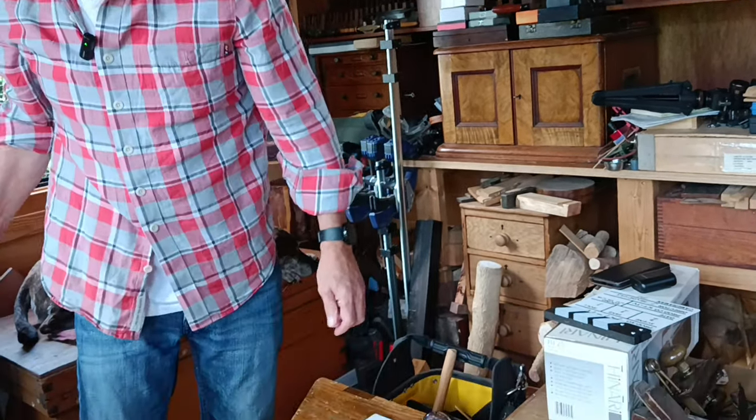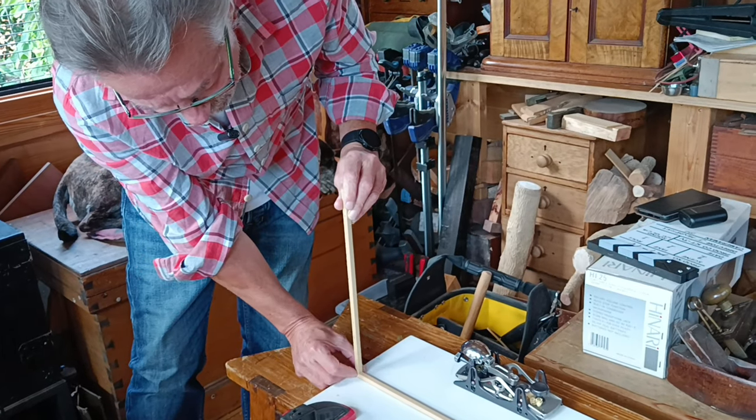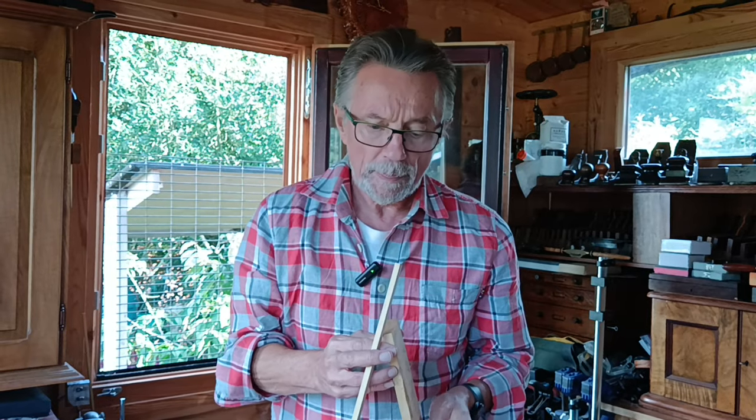So this week that's what I'm doing — making loads and loads of these beams all to size, and slowly but surely I shall be making mortise and tenon joints in each of the corners. And then we had a great discussion last night on Bench Talk, because I need to bore these. We worked out the pegs for draw boring to 1/20th scale, or actually one millimetre. So I'm going to get a piece of boxwood offcut and make toothpicks, then push them through a draw plate — which I've got on order — to one millimetre. And that will give me the scale size for putting draw pins in to pull the joint together. But that will be for next episode three, I hope. So you'll see me back again then, me and him, because we're always here.